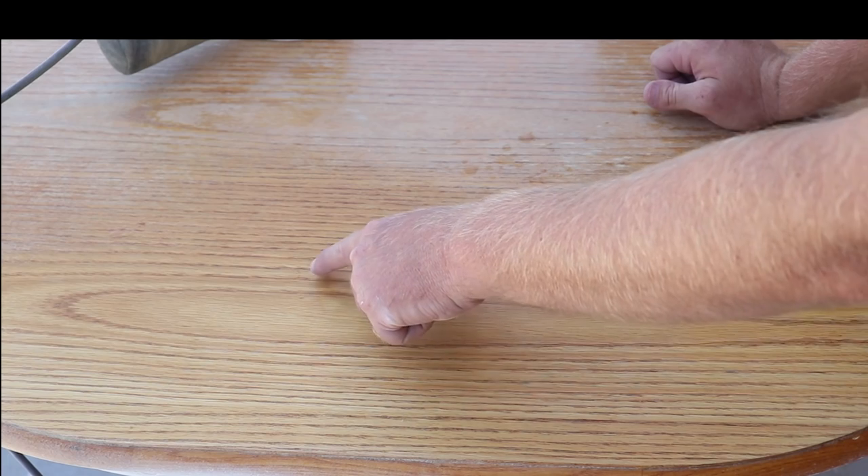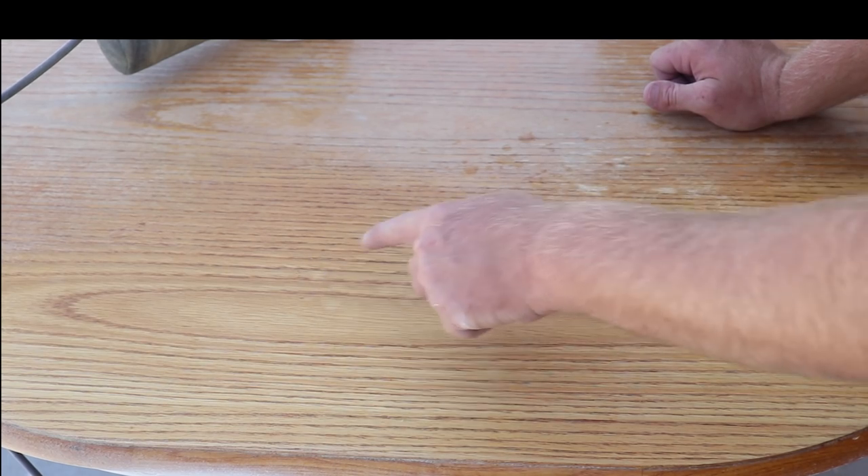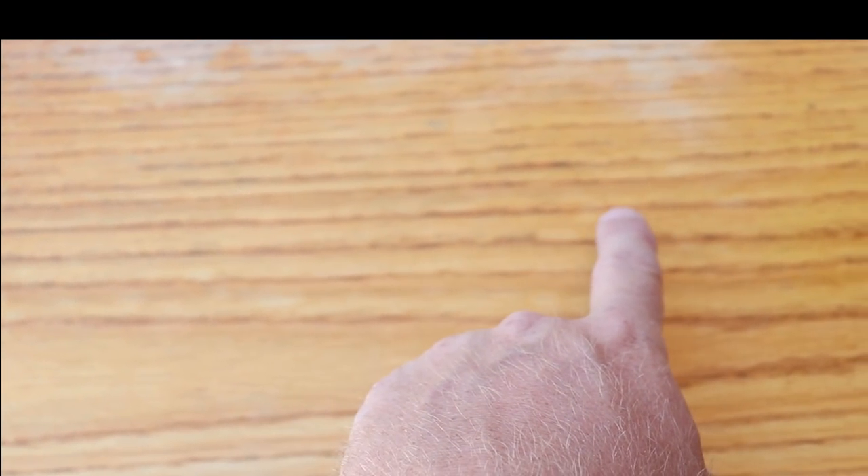You can see here I've got spots right here and right there. I'll bring it in close so you can see — there are little spots in through here and a couple of places over here where it's a little lighter, and that won't take the stain. I'll wait for this to dry out again and then re-sand that back down so it will absorb the water-based stain. Same for oil-based stains — if it's not sanded all the way down they won't take as well.